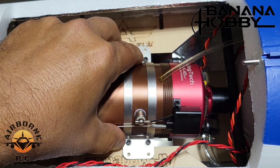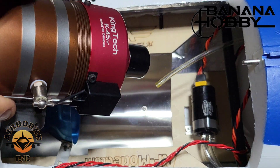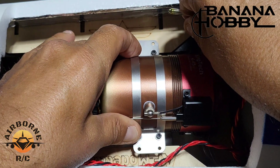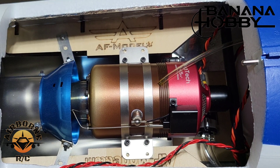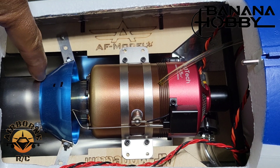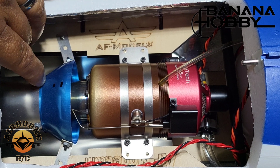From the back of the cone, from the rear of the turbine — I get a lot of people asking me about the spacing. The good rule of thumb on your turbines is half inch to three quarters inch from where the bell meets the throat. This right here is called the bell because it looks like a little bell. And this right here is the throat, or the mouth of the pipe, because this is where you feed it. So: bell, throat, and your pipe.